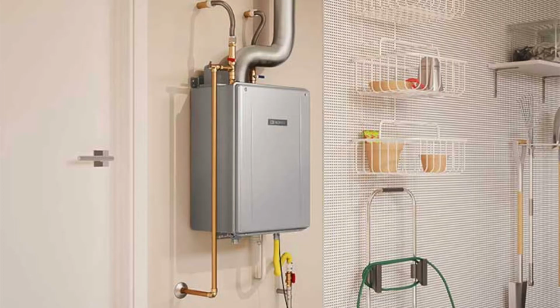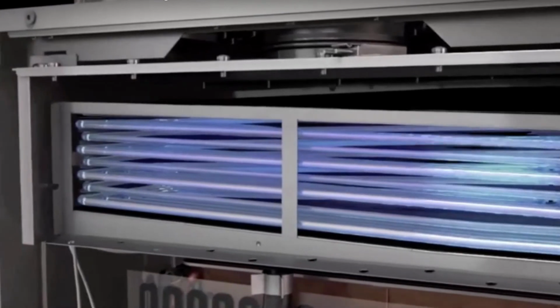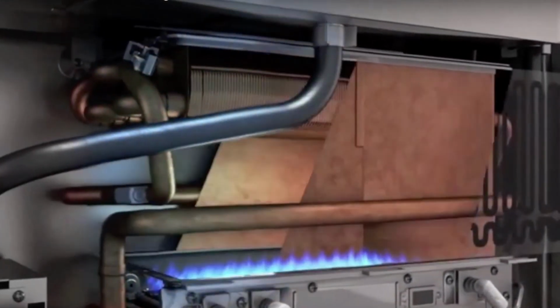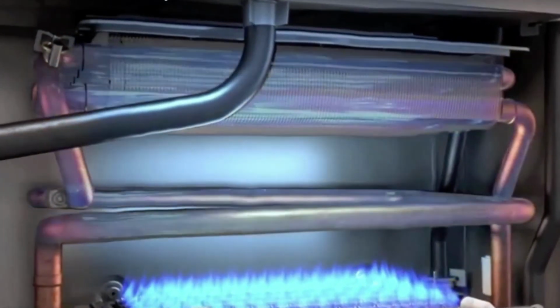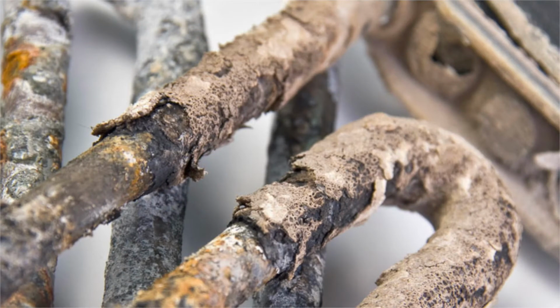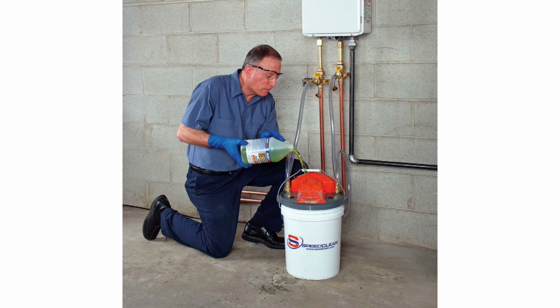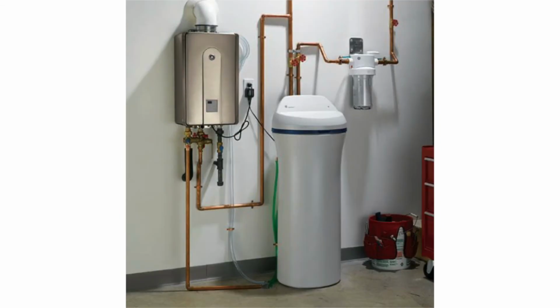One of the other downfalls to tankless water heating is that it's extremely susceptible to hard water, meaning a tremendous amount of mineral in your water. As it flows through the heat exchanger, picture a very small, fast-burning burner. As it goes through there, all that mineral could collect and then force burn that exchanger out, essentially the heart of the tankless heater. A tank type heater is much less susceptible to hard water, something to consider. There are flush kits available to run a vinegar solution to clean out the heat exchanger, or running soft water through it to extend the life of the product.